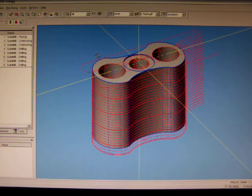But when you've got a correctly set up post processor, I can hit my button here, it gives me my code, I send that to my mill and it's ready to go. I put my tools in, I put my part in, I set my zeros and I hit the big old green button and then it cuts out my part.